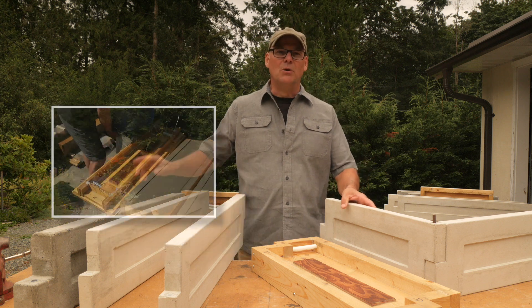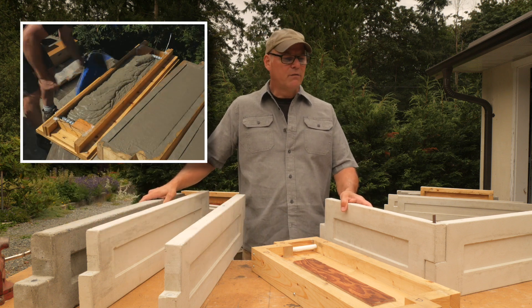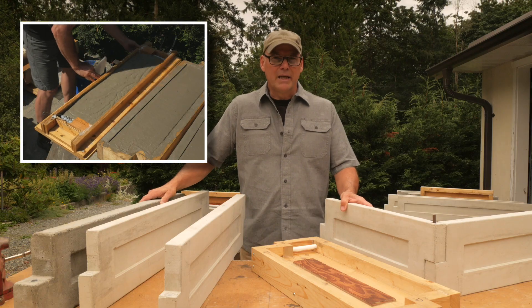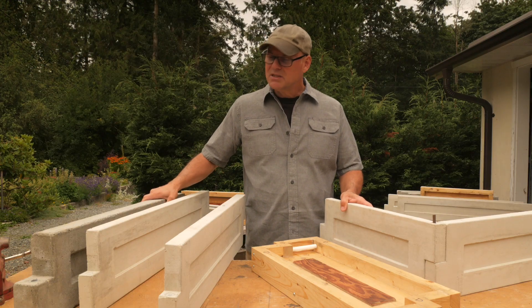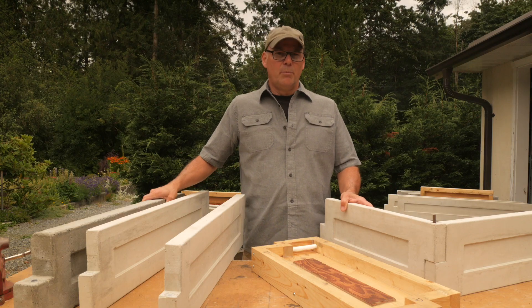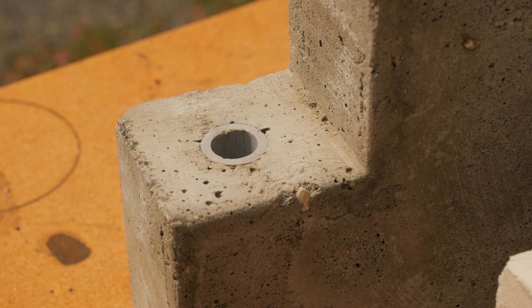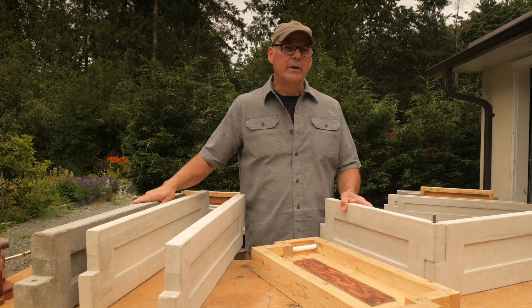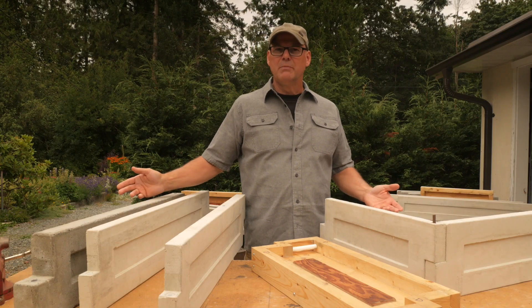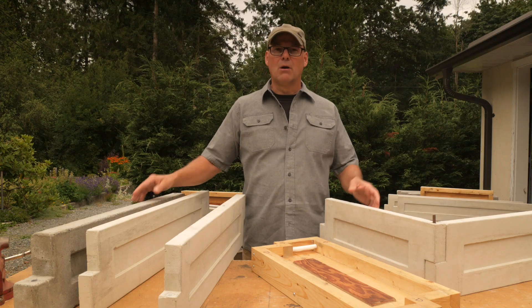In my last episode, I looked at making the panels lighter using a few lightweight concrete formulations. The panels I cast were designed for traditional Portland-based cement, and it has some limitations. The panels needed to be a certain thickness to have enough strength around the pipes. I started looking for ways to make the panels lighter by altering the concrete, but I think it makes just as much sense to find a way to make them thinner — just use less concrete.